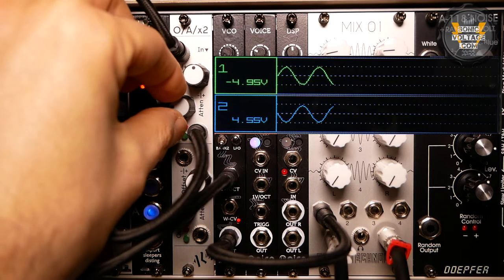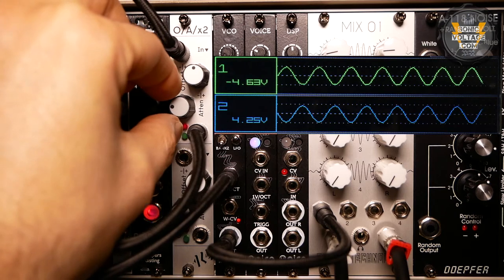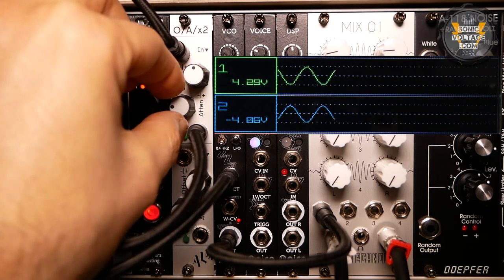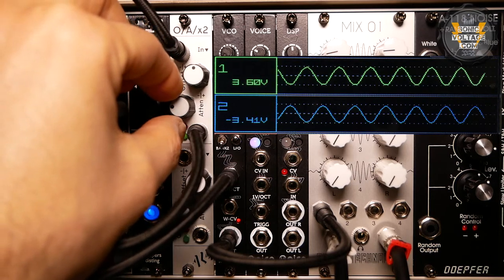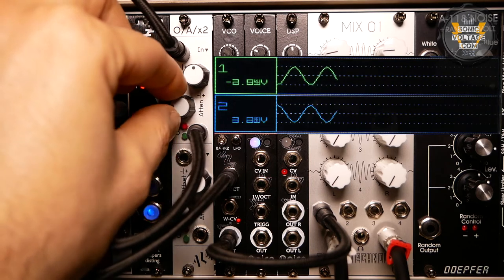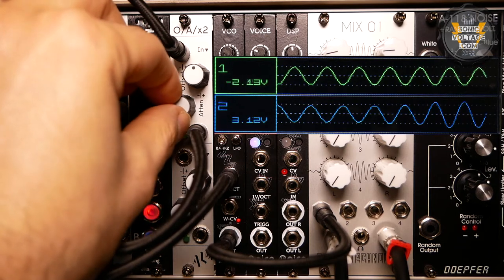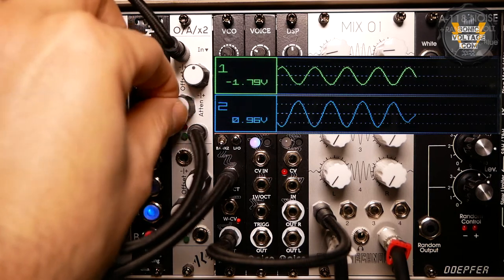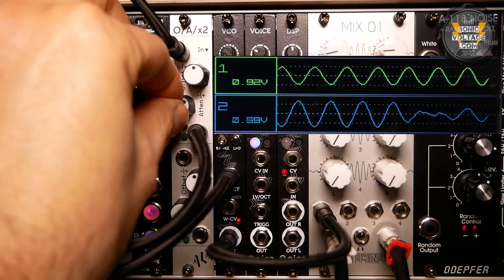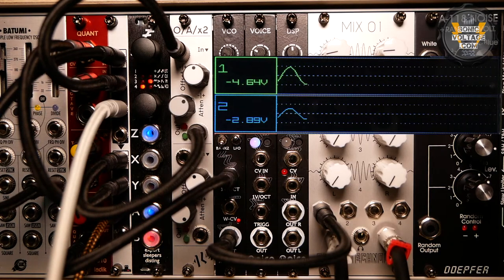With the DC signal, we were a few cents short of full inversion. With an alternate signal, not only can we reach a full inversion, we have an opposite phase signal with the same amplitude, and we can boost it further counterclockwise and reach those higher notes or lower notes with an increased amplitude. So that's very useful because not only can you attenuate and fully invert an alternate signal, but you can add some boost and make good use of it to manually change whatever the signal is doing for you,